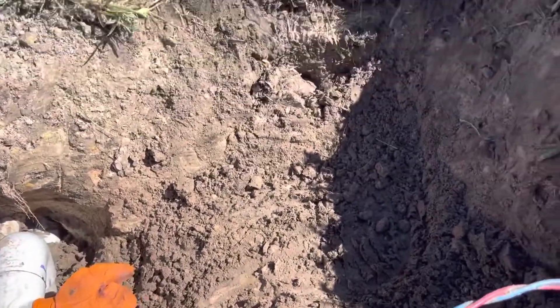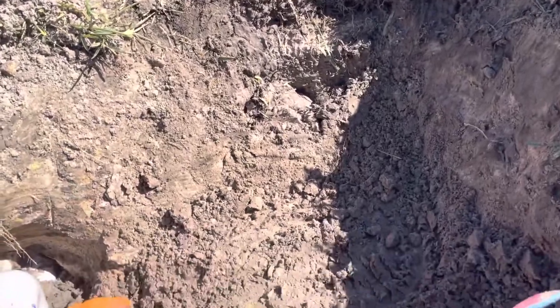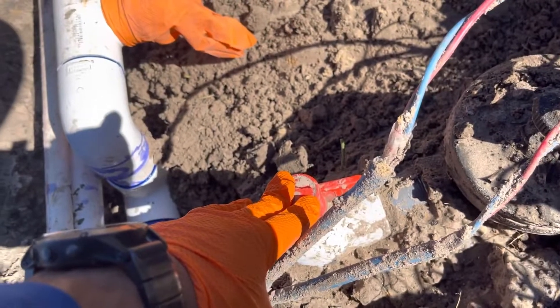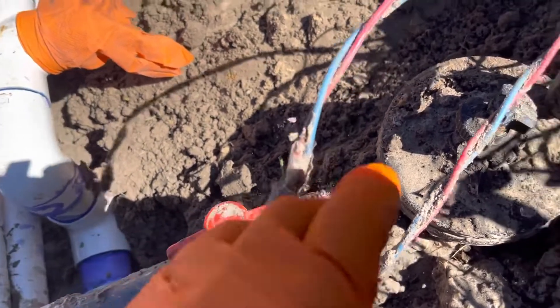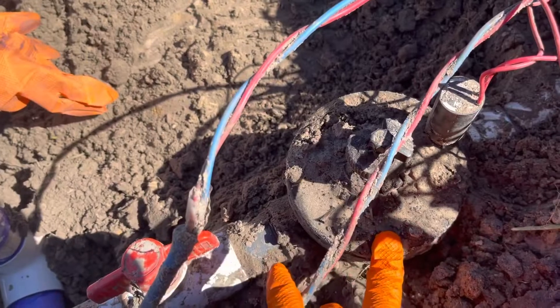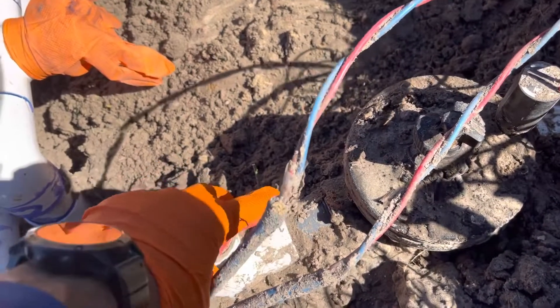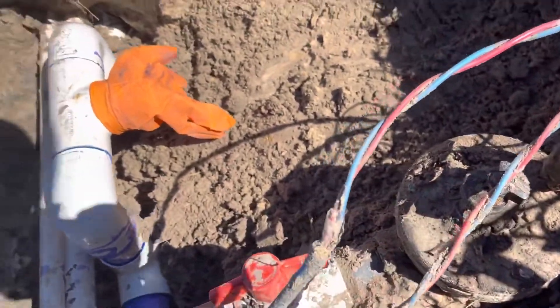It's an easy connector decoder — easy one. We're just adding on zone 12, which is this one here. We're going to connect this one-and-a-half-inch. We put a main shutoff in case the valve goes bad — a separate main shutoff for each zone. So if this valve goes bad, you can just disengage it from here, turn off the water, and make a replacement without shutting the entire system down.